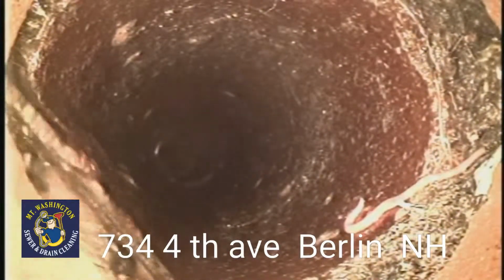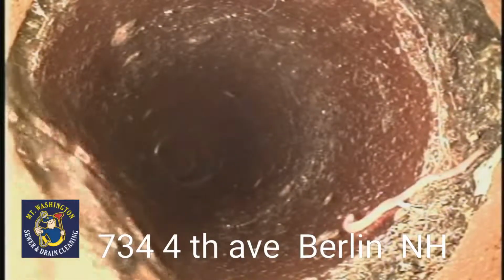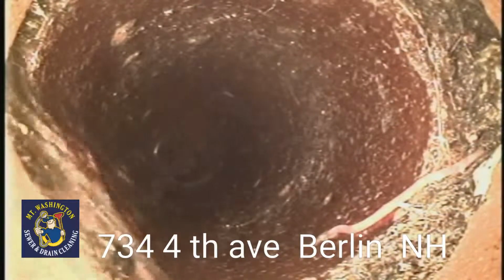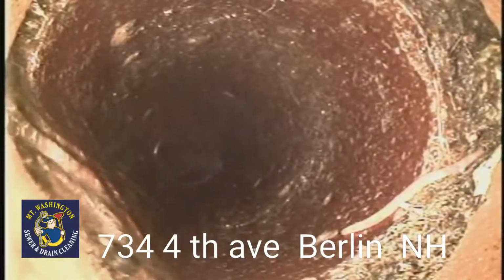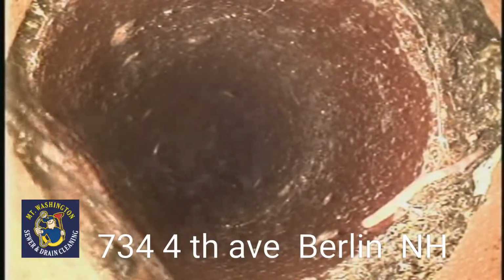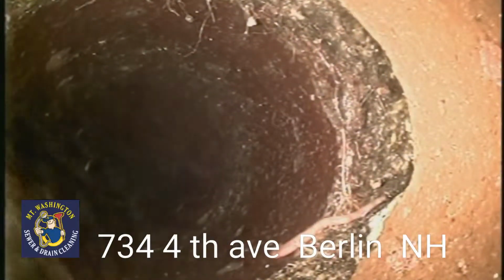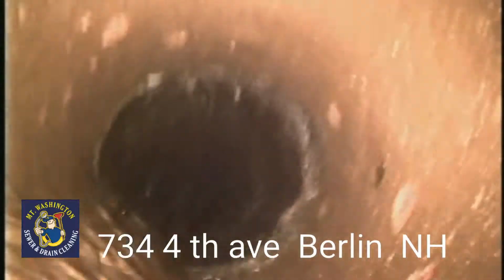Right at the 4 o'clock position, you can see a worm growing and running right inside the pipe. So he's having a good time in there. Worms can get in there easily. That's usually always a sign that there's a problem with the pipe. That looks to be at least a 3/4 to 1 inch failure on the side of that pipe. Oh yeah, right there. The tree root's absolutely starting to tear this pipe apart. I mean, the pipe is old, so it would be expected.